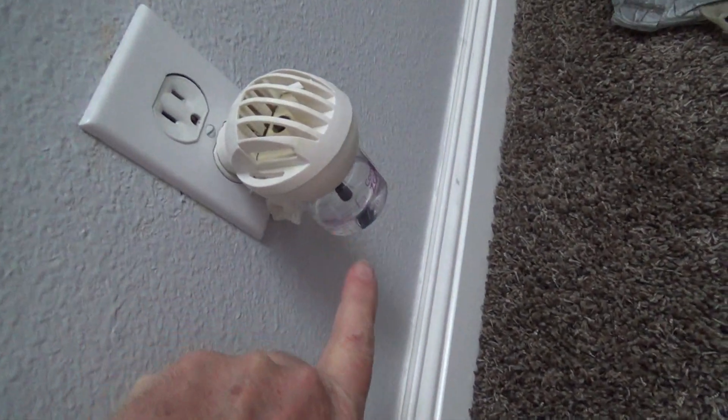If I wanted to check, I can hold it right in there. See that little notch? I can hold it there and push it in — that's pretty close. It's still just a hair short. So I can strip it a little bit longer. I don't have to do that for every wire; it's like if you forgot you can do this on the very first one. Then I can take my tape measure and measure. I think it's a little over five-eighths of an inch — just a little bit over five-eighths of an inch.